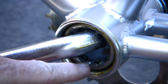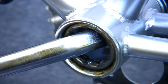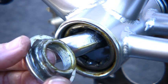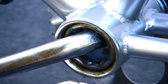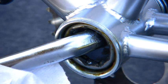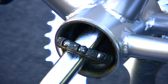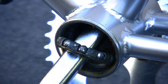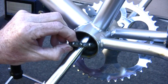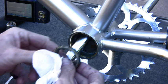There you see — there's the cone and inside is a caged bearing. The grease you see here is rather gray. That's an unusual color for grease. Maybe that's the way it was made, but gray is also the color of grease when it has become dirty with metal particles. The wearing-in process produces metal particles that make the grease gray. Out comes the first of one pair of caged bearings.